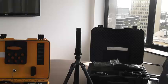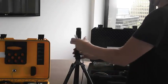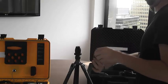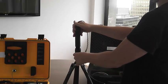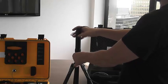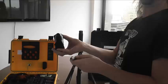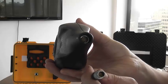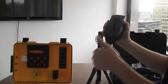The next step is to run the microphone cable — this goes up the mic adapter tube. The top part of the adapter can be unscrewed to run the cable up the stem, and the lower half has a channel that the cable runs into for guidance. Before you run the cable, be sure you are using the right end — check either the mic or the noise monitor ports to match them up and get this part right. The monitor has been lifted out for this example, but please ensure it remains at least partially seated in the foam while you perform these tasks.